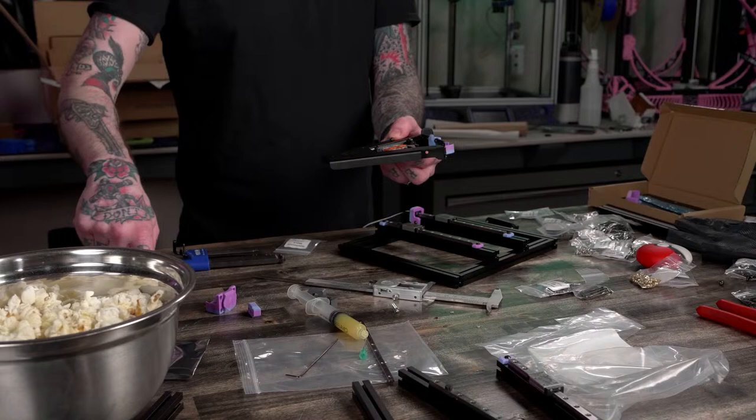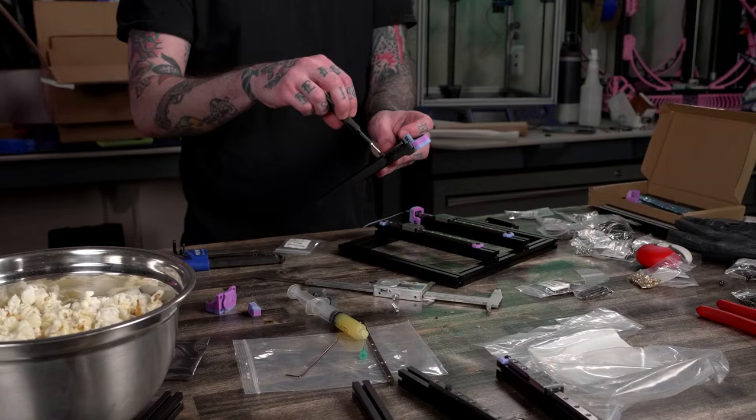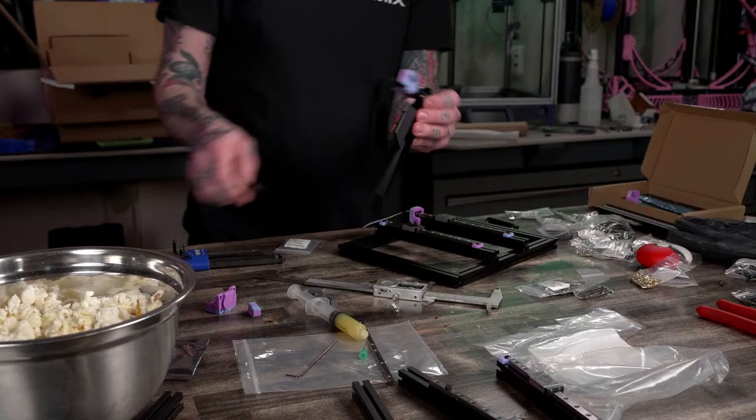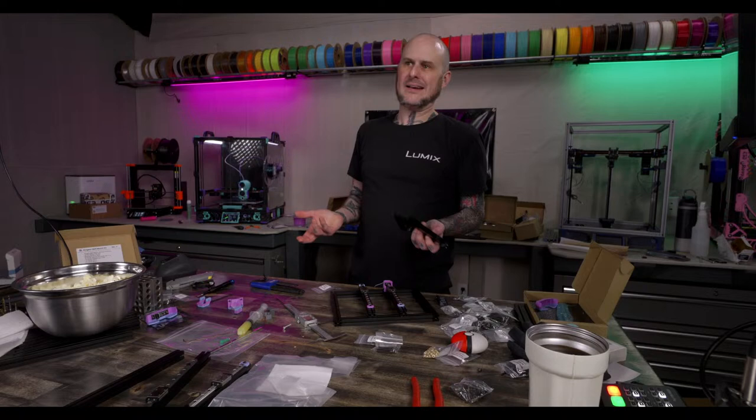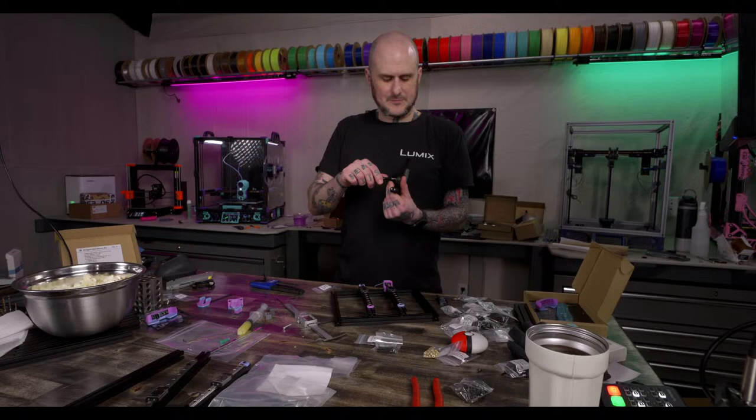Did I hear anything back from Drop Effect? Yes, I did. I am currently running the Drop Effect Next G in my 2.4, and I'm getting 40 millimeters cubed out of it all day long, and I'm quite happy with that. But it is only with a version of it that you folks can't buy, unfortunately. I mean, you'll get the same flow rate out of the Dragon version of it, but the Dragon version won't fit in my 2.4.